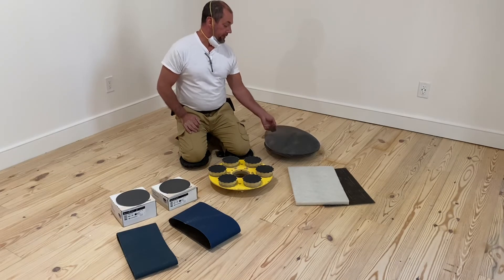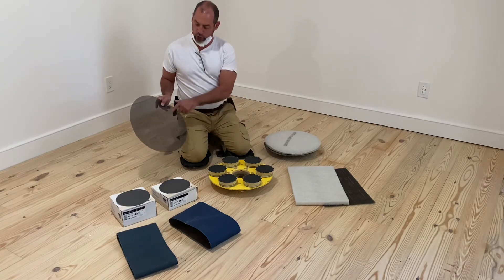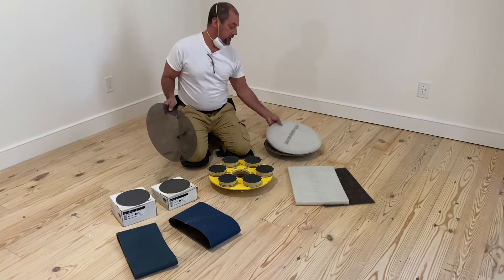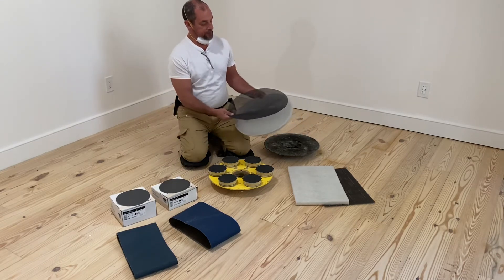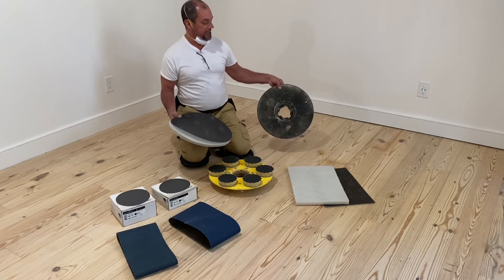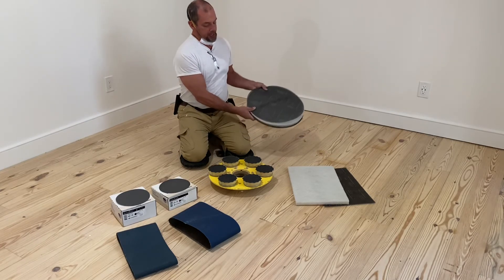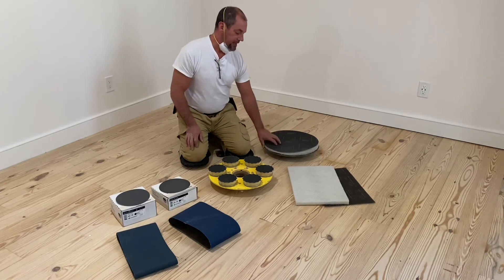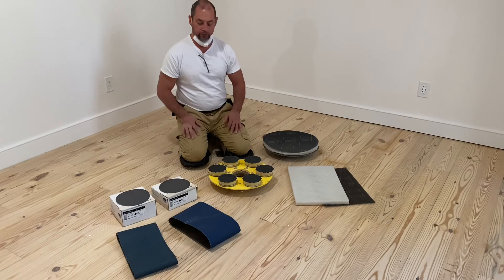The only other thing you're probably going to need is a 220-grit round head screen. For this screen, it comes with a round white pad about an inch thick. It's 16 inches across — a 16-inch pad. And you also use a different head. This is a flat head. It's just got little knobs on it and it grips the white pad. And you use a six-disc and a flat head with the same buffer — the continuous orbital motion buffer.